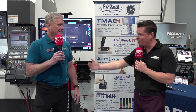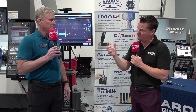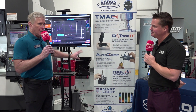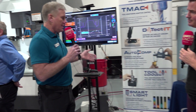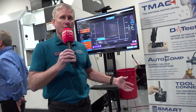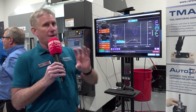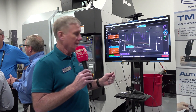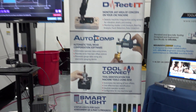We've been into Okuma manufacturing together and there are actually two options for Tool Connect. Exactly — the RFID is a really robust method, slightly more costly, but there is also another method which is a QR code. The dimensional data — the length and diameter, maybe the tool number — can be printed on a barcode or QR code. We can use a barcode reader instead of the RFID system and still perform a lot of the same operations.